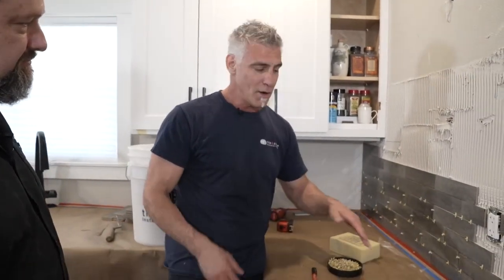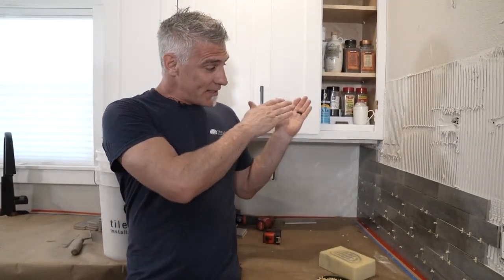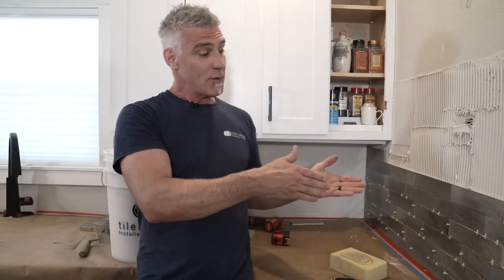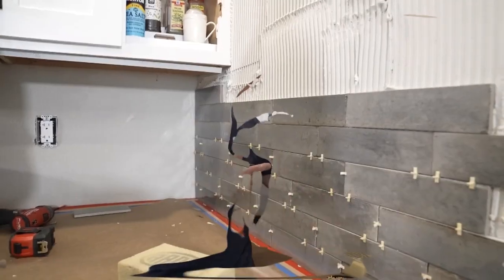What are some tricks for somebody tackling this at home for the first time? It all comes down to having that first row. Once you have that first row set, everything's going to stack off of that. To make sure your pattern stays correct, sometimes you have to stand back and look at it, because when you're right up on it your pattern can get off and your brain doesn't even see it. Another little trick: pull out your phone and take a picture. Things that look good to your eye — when you take a photo, all of a sudden you can see where there might be a gap or the spacing might be off. It shows up in the photo but your eye doesn't see it.